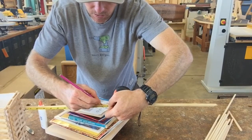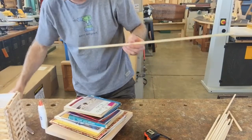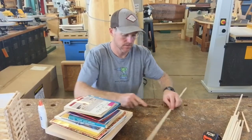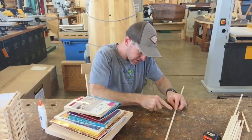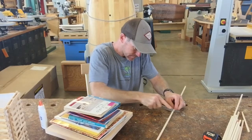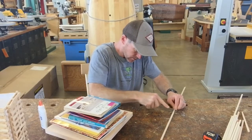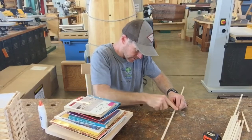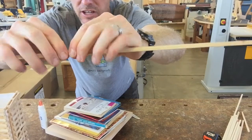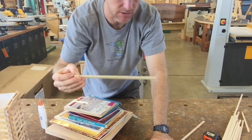I've got my 11-inch mark. I'm going to mark the first one really accurately. Now we get our cutting device — our beautiful butter knife. I'm going to score it all the way around on all four sides, just like that. Then I put my fingers next to it and shake it back and forth to break it. That should be 11 inches long — let me check it.